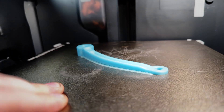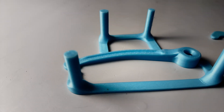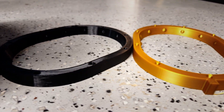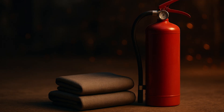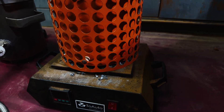Let's try making that second mold. Project B is fun because I can run it as either a two-part mold or an open-faced mold if the two-part fails. I'm going to try the two-part first, as this geometry is much simpler and the mold volume is much smaller, so the sand has a better chance of surviving the pull. Editor note: you'll see a change of scenery — I kept fighting the two-part mold and tried a smaller printed mold to test. Printed plastics and molten aluminum are not friends. I am in full PPE with two fire extinguishers and fire blankets on standby, and I switched to my electric furnace to stay inside city noise rules.